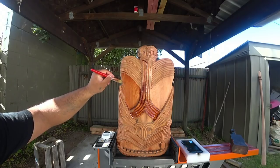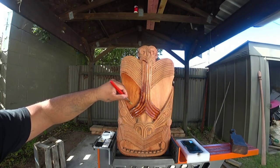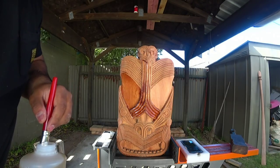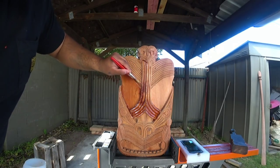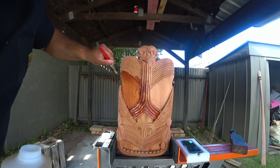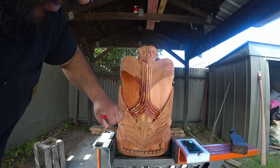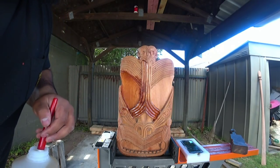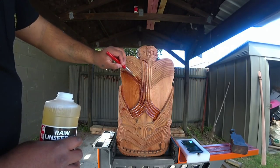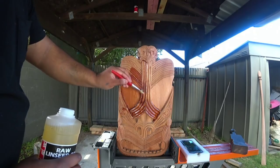Maybe some technique we will do is stain the empty brow here a darker stain, just so it gives a little contrast for the wood and the design. Now it is said when you stain a carving, you're not finished when you finish a carving - usually the last thing that goes in are the eyes. The particular material used for the eyes is the abalone shell. After the stain, we will dig out the excess wood in the eyes and place in the abalone shell. As you can slowly see, the linseed oil starts to seep into the grain of the wood, thus showing a different texture to the entire carving.